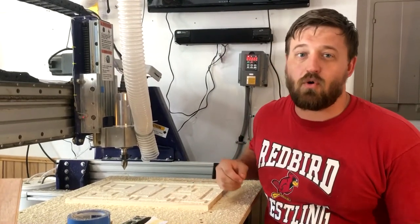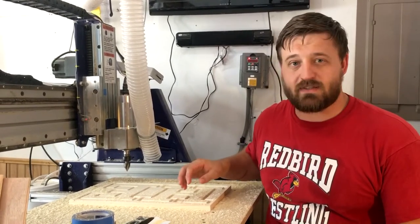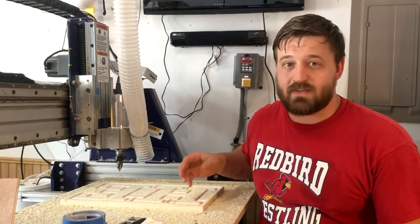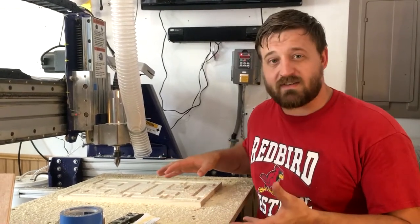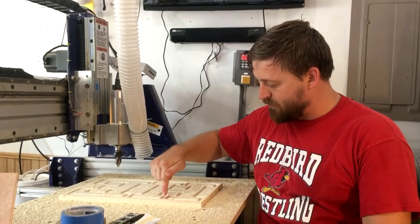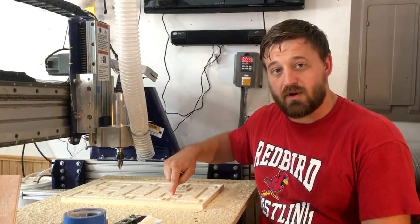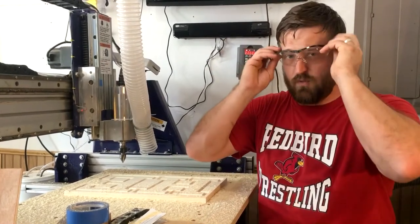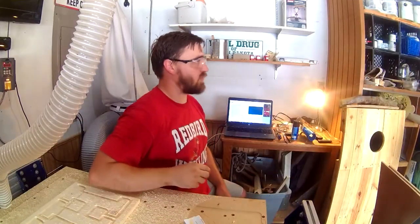This is the moment of truth for my new hold-down system. If you're ever going to cut out an entire shape on a CNC mill, you've got to make sure that remaining shape is fastened to the table. I'm hoping I used enough tape and glue to keep everything fastened down, because this center part of the H, by the time my profiling is done, won't have anything holding it except hopefully some tape and glue on the underside. To play it safe, I'm going to be standing far away with my safety glasses, and the old action cam will capture anything fun.